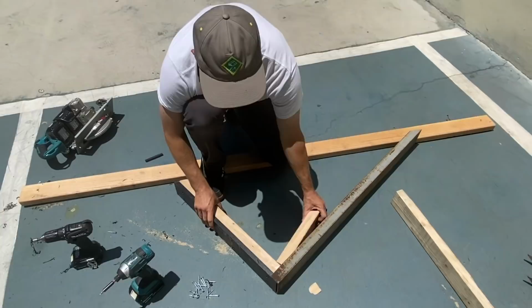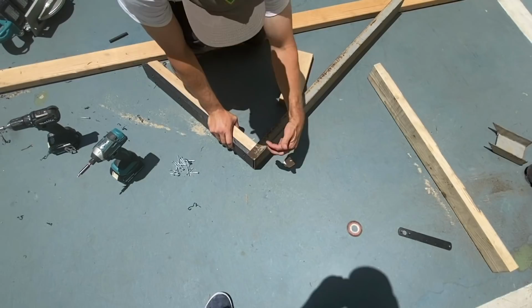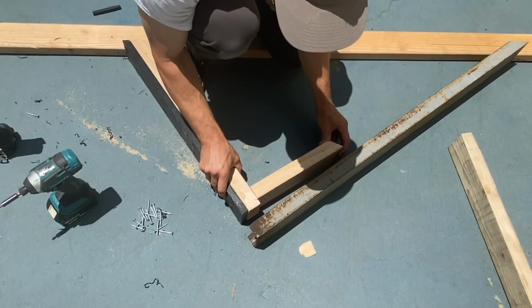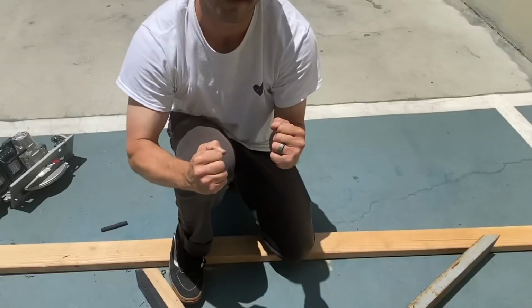This is gonna go here, right? Mm-hmm. I'm gonna do some holes and countersinks through there so that bites that. But that's only two screws that we're gonna rely on. So I think if I put this here, now I could bite it that way with the wood on top of being able to go boom, boom. So now I've kind of stiffened the whole thing up and I've made a nice little triangle.